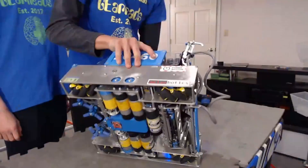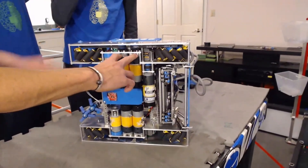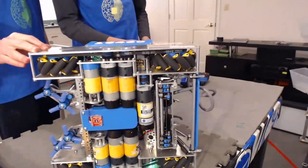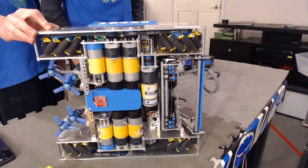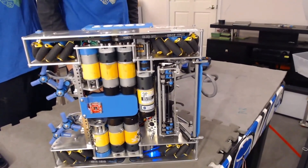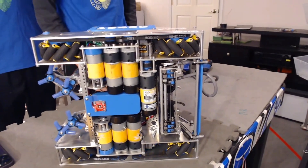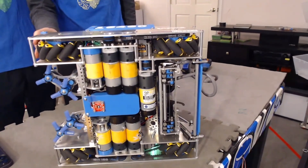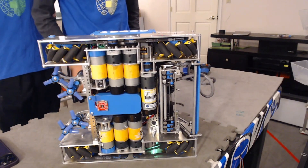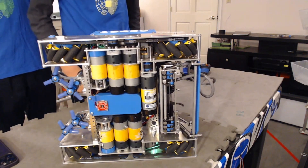There's a servo with a linkage that comes between the two black gears driven on the drivetrain motors, and that engages the four drivetrain motors as well as the two lift motors — so we have six motors lifting the robot at once, which makes timing and reliability much better. Have you looked at the current draw? We designed this to be at around peak power, which is around 15 amps — a little close to fuse capacity but we haven't had issues yet. When we tried to do the level three hang, we did have a blown fuse, so that's something we need to investigate.